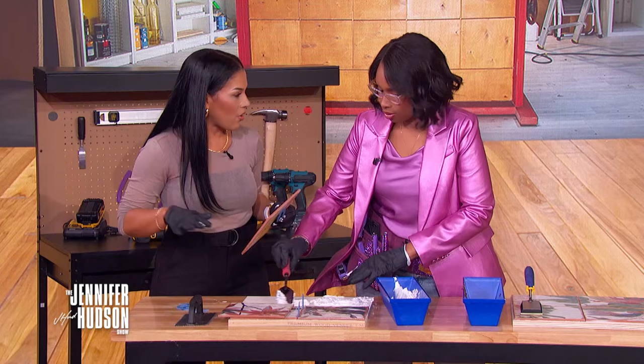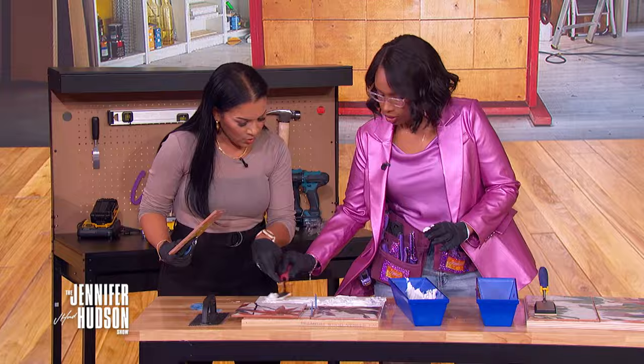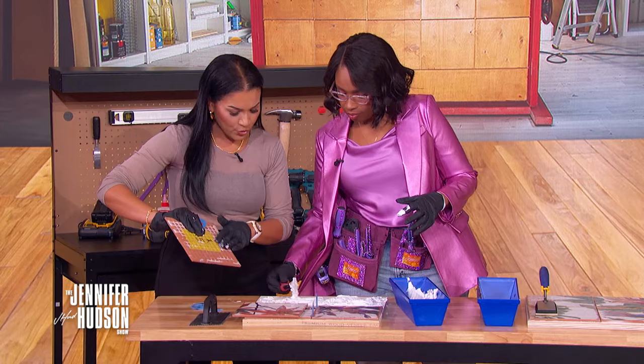We have to let this glue and the tile stick for about 24 hours before we can put the grout on. But we'll get to that next. Go on your tooth side — the comb side. We want these kind of grooves like this all over.